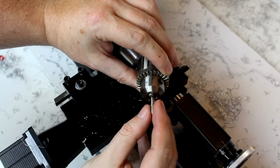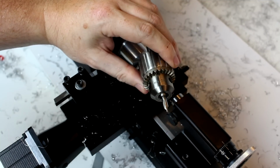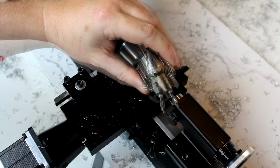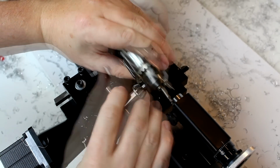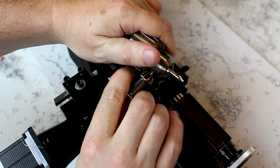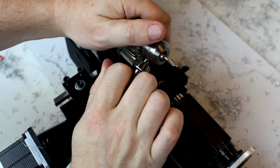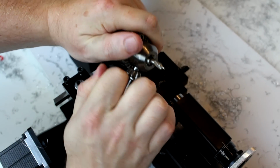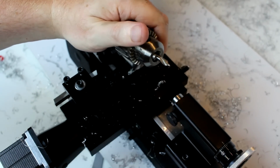And we're going to start with a center drill. So the same rules apply. Tighten it up fairly close to the flutes. And then use the included key to tighten it up. If you're worried about it slipping, you can actually go to all 3 holes, and that will give it a little bit tighter fit in holding that on there.